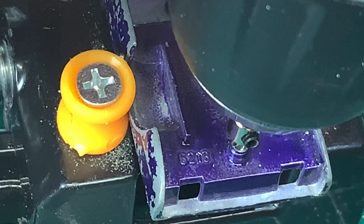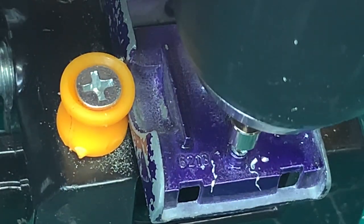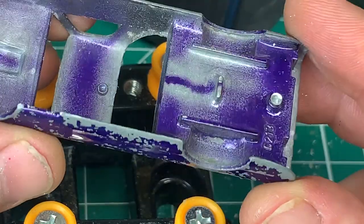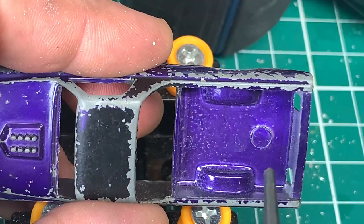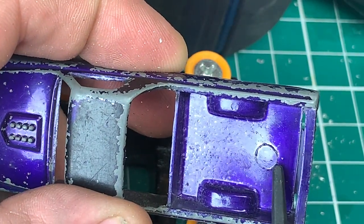For the rear post, I'm going to use my little bushing so I don't go all the way through to the bed. That particular portion of the casting is very thin — it's going to be very easy to drill all the way through. You can see right here we've got a little point where we almost went through.